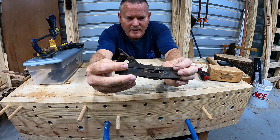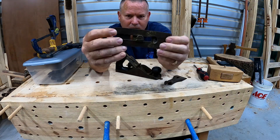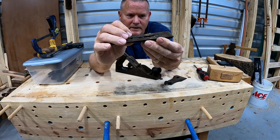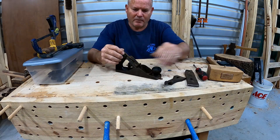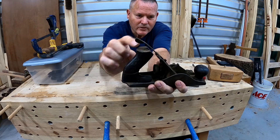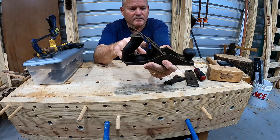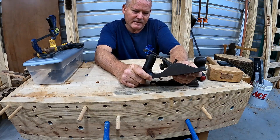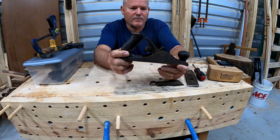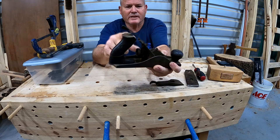It's in pretty rough condition. I don't know if I'm going to put this in electrolysis or not. It has all the parts. Someone obviously was beating on the back of this thing, so I'll fix and clean that up. You can see it's a tiny bit bent. The chip breaker looks good but the iron is bent. I haven't tried to really take this thing apart yet. The lateral adjustment has been bent and the back of the tote is broken.